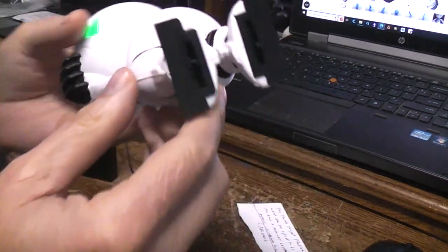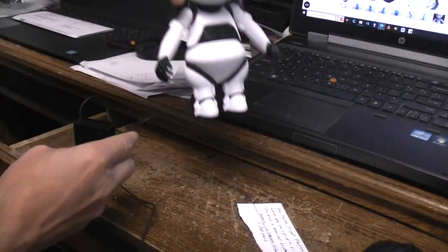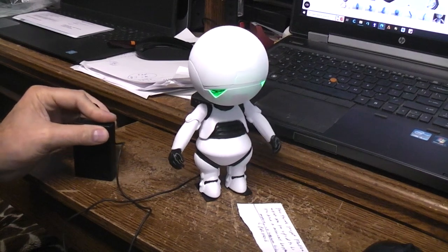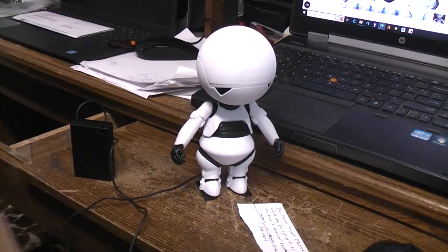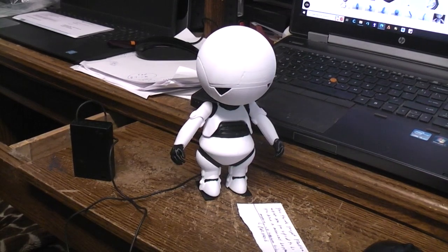As you can see it's a pin-locking design. I'm using the N20 dual-shaft motor — it's around 30-something RPM at 3 volts, but I'm running it at four and a half volts, which gives it a little bit better walking speed.